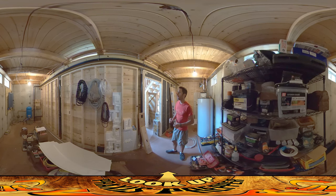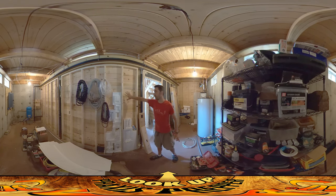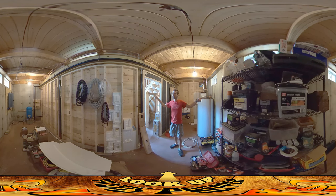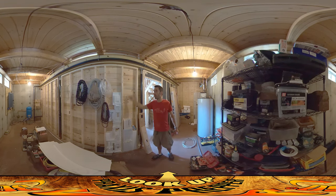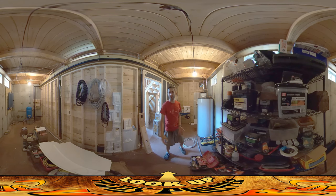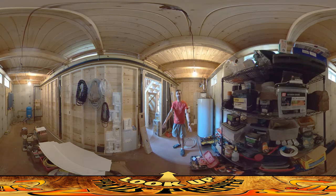Now there are two reasons for that. The first reason is that I'm required by the energy building codes in this area to actually put four inches of foam on this wall. We have four inches of foam on the outside walls. They're saying we need four inches of foam on this wall between the pantry and utility room and the rest of the house because I left a small section of floor — maybe about 15 feet — underneath this area uninsulated.